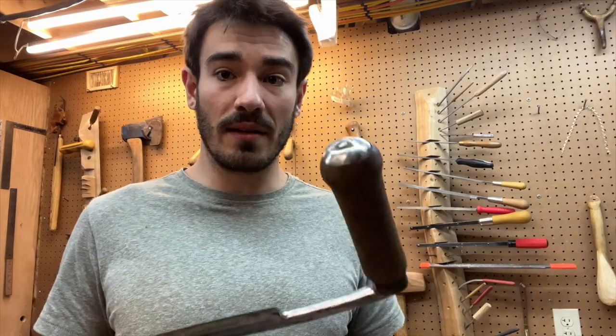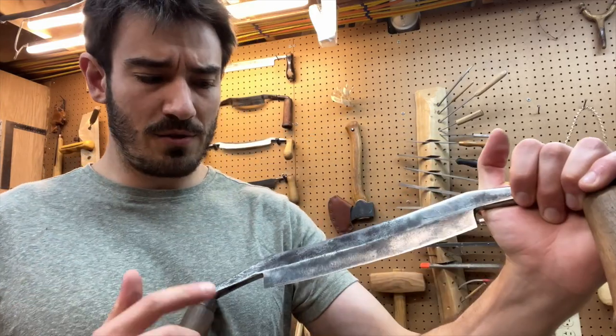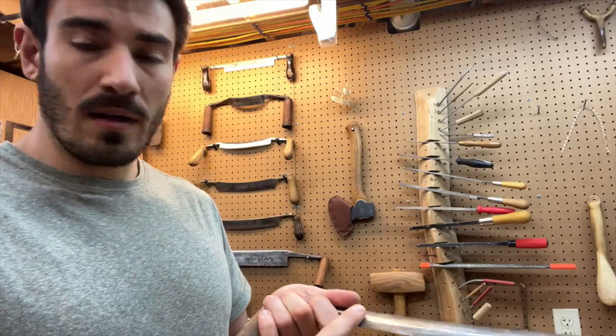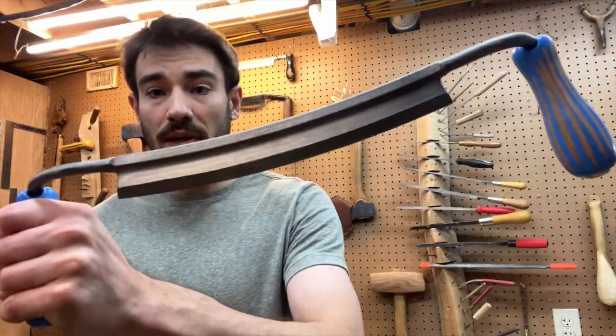And once again, as with any power tool, keep some water handy and never let the steel get too hot. You can burn your steel really quickly and totally ruin the temper. By the way, I would not ever use a Dremel on the back of the knife. It's pretty hard to maintain the flat with a Dremel, but they are handy for forming the bevel. All right, let's show you an example.